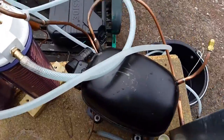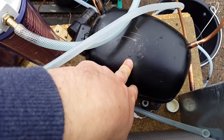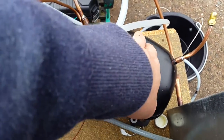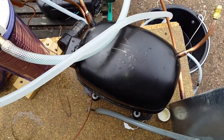The other compressors you get — the big one horsepower ones — they can run their evaporators at 5 degrees C. But the warmest you're allowed to run the evaporator with this compressor is just minus 5, which I'm not sure is ideal for this heat pump application.